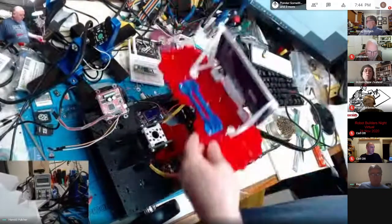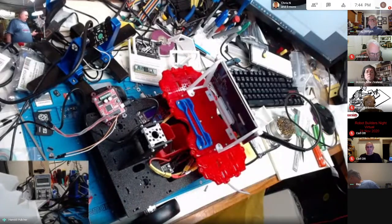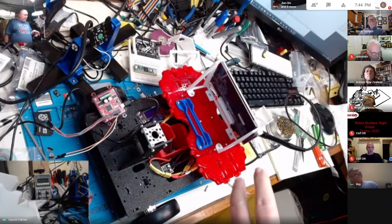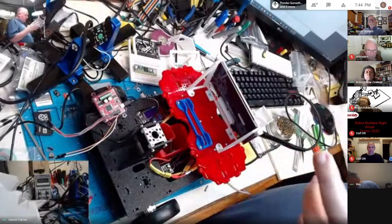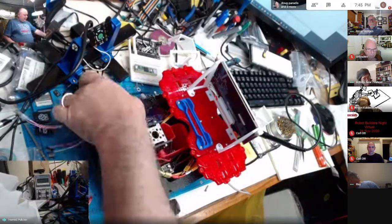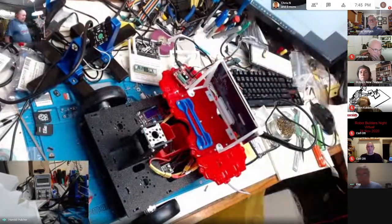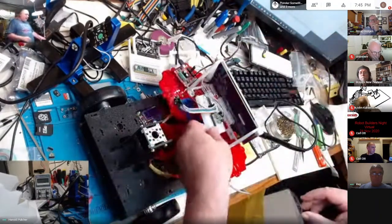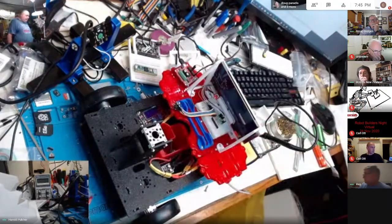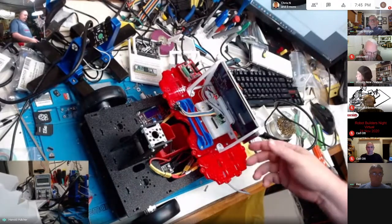So what's going to happen now is this is the top. I did have my USB expansion mounted right here, but I've worked it out so that I can use all the ones off the Latte Panda for right now. When I go to add a camera or other things, I'll have to do something else, but that's not what I have right now. So what I'm going to end up doing, I got enough wire, enough cable, and I'm going to slap this motor controller, make sure people see it, over here on the side to make that nice and easy to get to. And this is a stand-in for where my Teensy's going to be. I've got enough room to put that right there so that I can run wires over to the motor controller and then have the USB coming out of here. And then everything is on top.